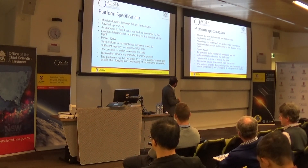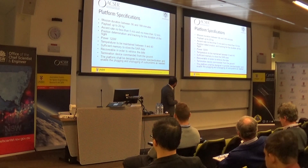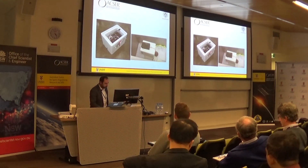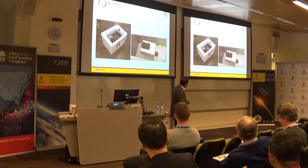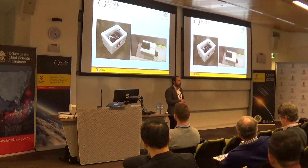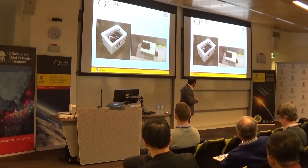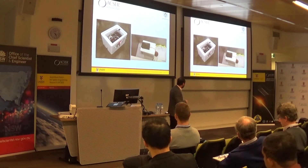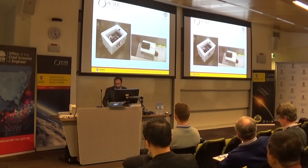Flight time is 90 to 180 minutes — that can be planned. Payload up to 20 kilograms, and we want the payload to be recoverable. This is one of our light balloon mission payloads. Up there, temperatures can go down to about minus 70 degrees. We need protection — we've tested it in a freezer down to minus 70 and it works fine. Although, what we've seen is that battery drain is noticeably worse at that temperature, which makes sense.